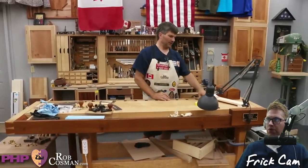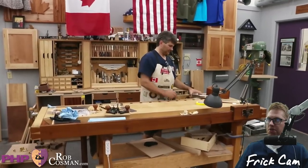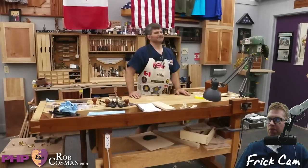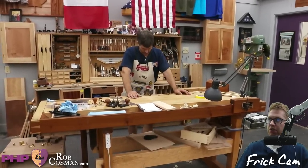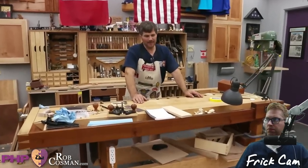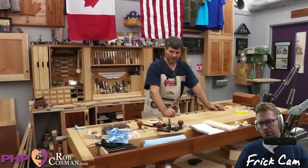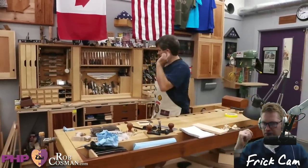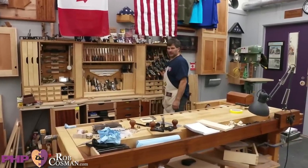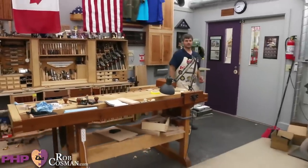You got another one? Yeah, Dwight Lee says, I want to replace my Stanley original blade with an IBC, but can't get the set with the chip breaker. Can I get by with just the blade without the chip breaker? No. We've been hammering them, trying to get them made again. The reason why you can't put a big, thick IBC blade in an old Stanley plane is because the yoke, the yoke. So if you take this apart, where it's a... There's an old one right here. Where? Okay.